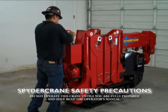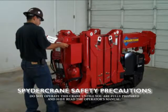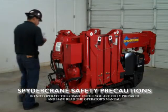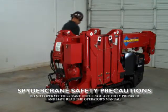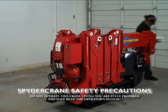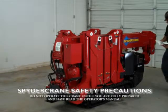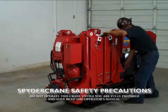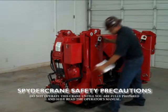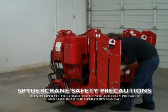Spider crane safety precautions. Always wear protective clothing such as hard hat, steel toe foot gear, safety glasses, shirt and pants. Read and understand the operator's and maintenance manual for model URW 295 prior to operating the spider crane. Perform a daily walk around inspecting the spider crane for damage and or excessive wear. If required, call a local spider crane dealer for parts and technical support.